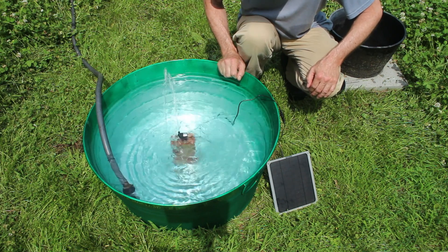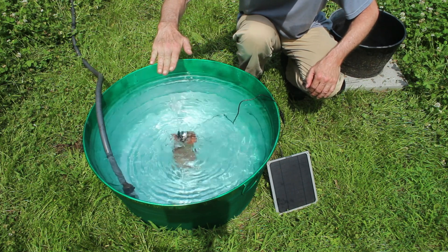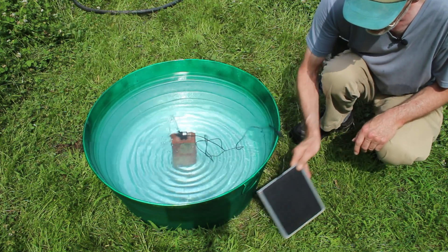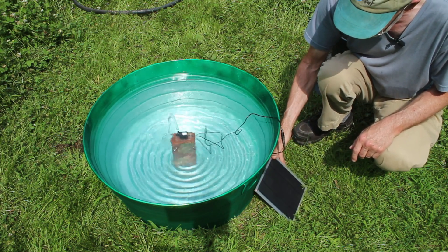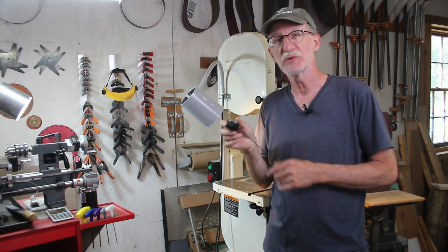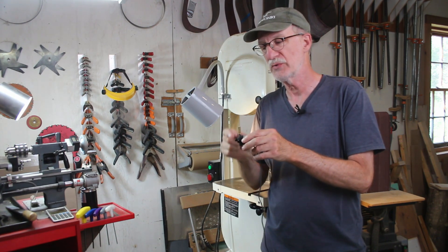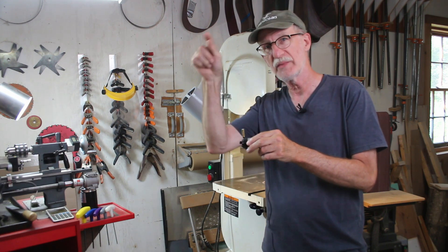That's what I had in mind — that's a great little fountain! That's about a 12-inch rise there. The tracking system will sit here and optimize the power to keep it at its optimal fountain height. In my test, I mounted the tiny pump onto a brick with a piece of acrylic so the rubber suction feet could stick to it, but I realized that wasn't going to work because the fluid level could go above or below the pump and impair the flow.